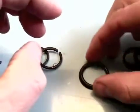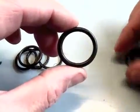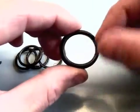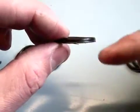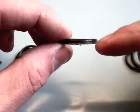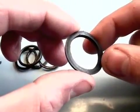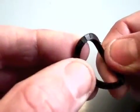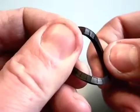This O-ring has been in for a number of years — probably six years. On the inner face, facing into the air reservoir, it looks quite clean and quite rubbery. But if I turn it sideways on, you can see this edge has now become very square and sharp, and you can see where it's deformed into the lip of the edge of the air cylinder, like it's supposed to. On this side it is very square, and it doesn't look too bad until I hold it up to the camera and twist it — and you can see all the cracks and the deterioration.